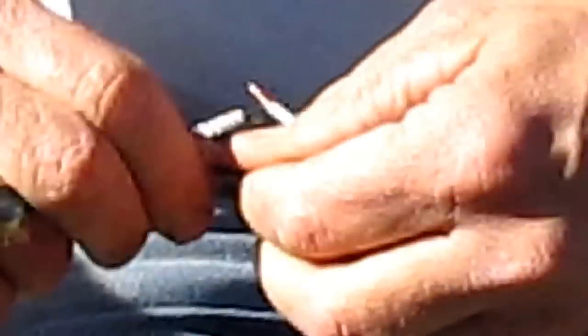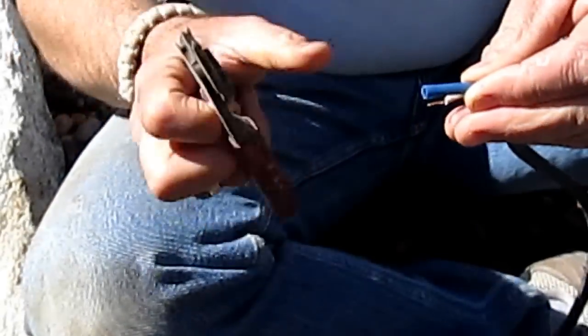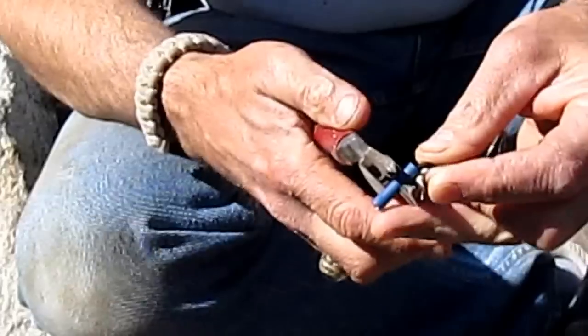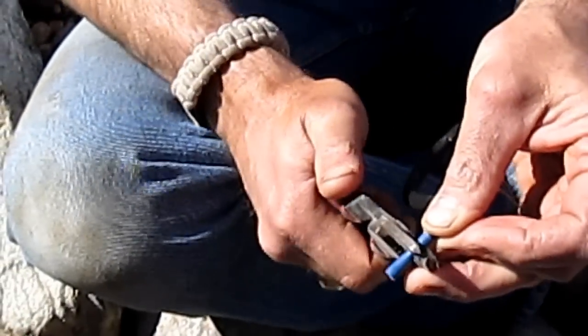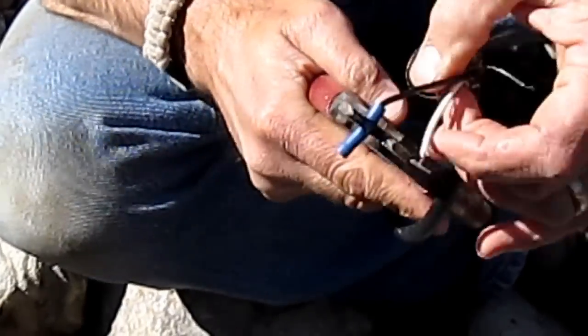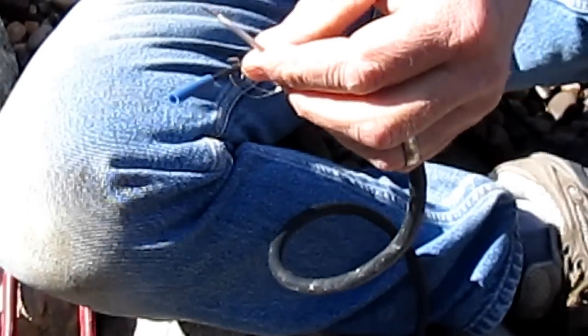Twist them tight on each one. Grab one of your electrical connectors, slide it inside. Take a pair of your lineman's crimpers — I always like my jaws at the very bottom; it's just easier for me to maneuver it that way. Push with one hand, make sure your wire is still inside, push in, crimp down, hold it really tight, throw a second hand on it, crimp it down. It should be so tight you have to push it away from the jaws. And you know it's not going to come off.